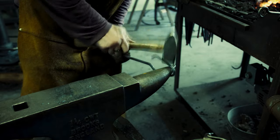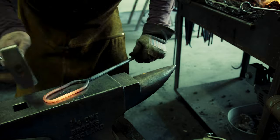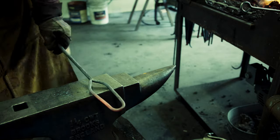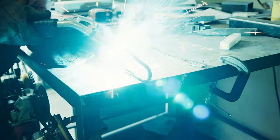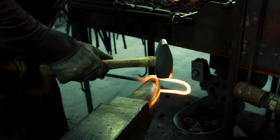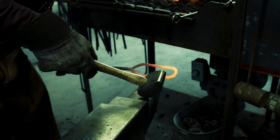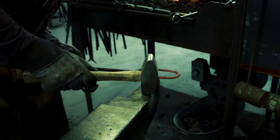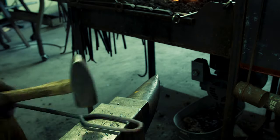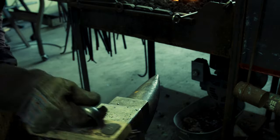After many adjustments and going back and forth, I am happy with the handle. It is time to weld it and then fine tune one more time. I am careful to not forge directly on the weld as it is at least initially brittle and might break open. I feel like I spent more time on this than on anything else on this project.